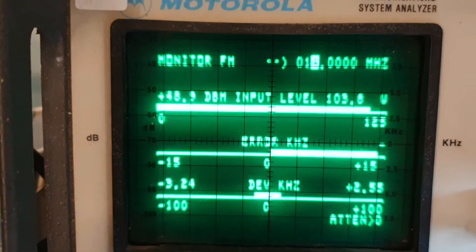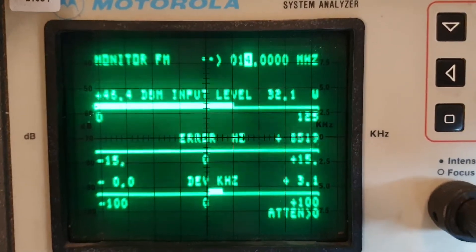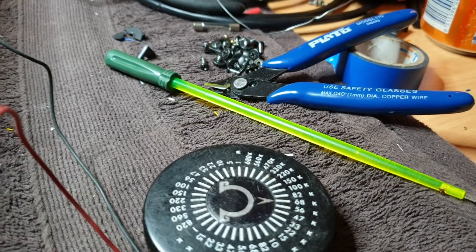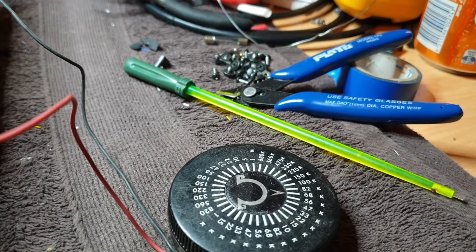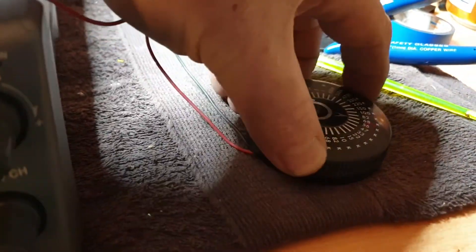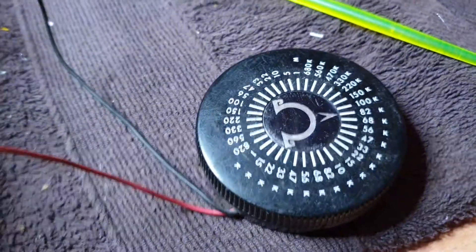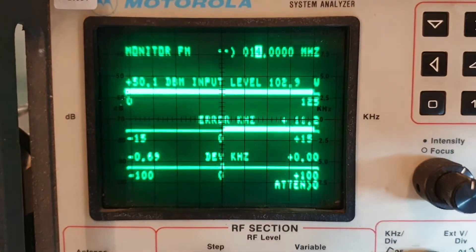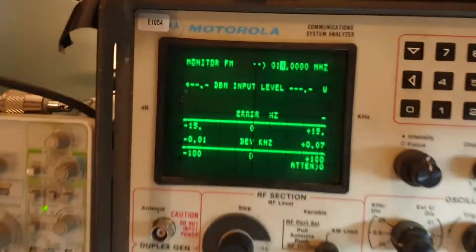Moving up to about 68K - on a quick CW carrier that gives us 105 watts, and we're getting a better average on sideband too. You can increase it further. With this resistor wheel mod, somewhere between 68K to 82K ohms will be fine. Moving to 82K picks up a few extra watts. At 100K we're really splitting hairs - getting 109 to 110 watts output.